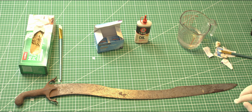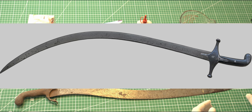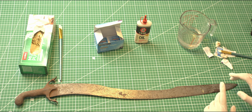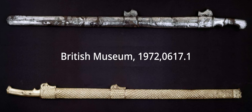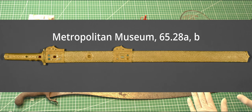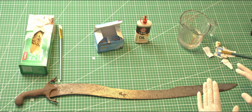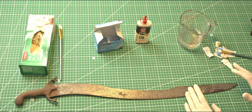As this gets to work, I'm going to explain a tiny bit more about the history of these Iranian swords in general. In Iran, the word for sword is Shamshir — you might be familiar with it as a heavily curved sword with a horn, ivory or wood grip, pommel cap and guard. That isn't really the first distinctly Iranian sword. If we go back further, for example to the Sasanid dynasties, we see long straight single-edged and double-edged swords with a so-called pistol grip. The Metropolitan Museum of Art in New York has a very spectacular example with a full gilded scabbard. From a relatively early point they were using crucible steel to make these swords, and at some point started making their own crucible steel in at least three or four locations with varying chemistries.